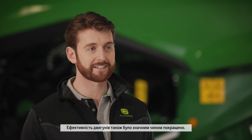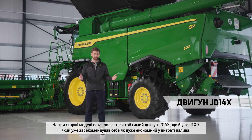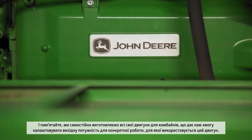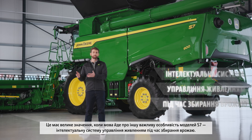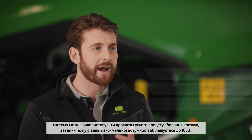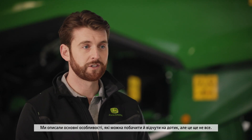The top three models share exactly the same JD14X engine as the X9, which already has a proven reputation for fuel efficiency. Because we make all our own combine engines, we can tune the power output for the specific job application. This is important when it comes to Harvest Intelligent Power Management, or Harvest IPM, available with the ultimate tech package. This doesn't just give you a short boost to keep harvesting when unloading — you can access it throughout the whole harvesting window, enabling you to set your max power target at 105%.